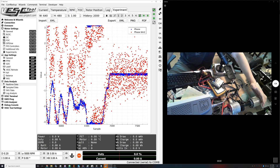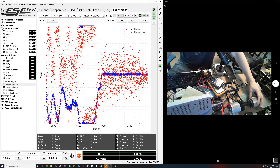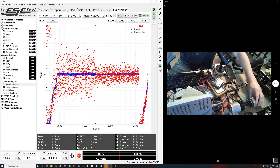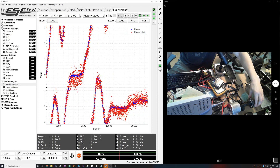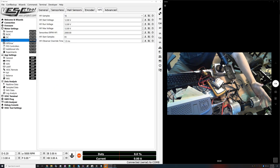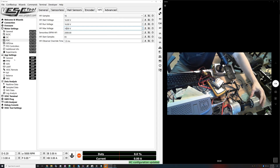At 8 volts the red is still not dialed in. Let's come back and try 12 volts to see what happens. Write the motor settings, go back to real-time data, and brake again. You can see that slowly our red is starting to dial in on the true motor position. Spin the motor around too, because it gets a little different depending on where you are in rotation. At 12 volts this is still a bit noisy — that line should have a little less spread. Let's bump up to 16 volts, going in 4 volt intervals.